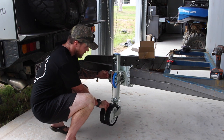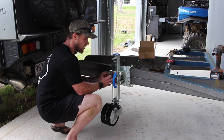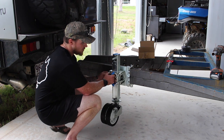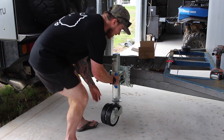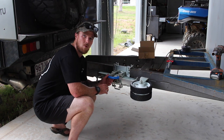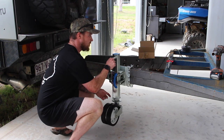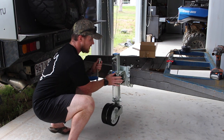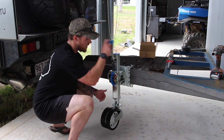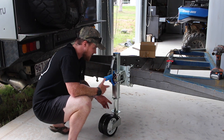One of the first things is I can pull the side out and actually slide that in, and keep moving it down lower and lower as opposed to having to wind it out all the way. Having the jockey wheel closer to the casing means it's stronger. The next thing is this handle to pivot the jockey wheel - it gets out of the way: pull it out, hold it up, and then fold it flat so it's completely out of the way and not going to be sitting there catching debris, getting plowed by rocks, branches, tree stumps.